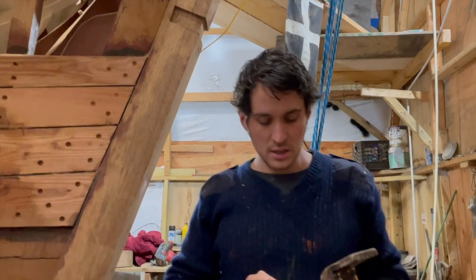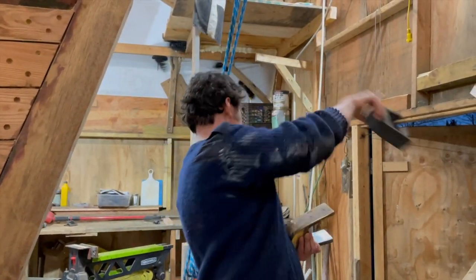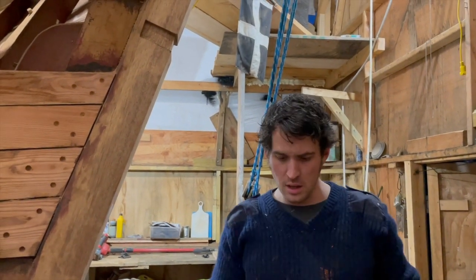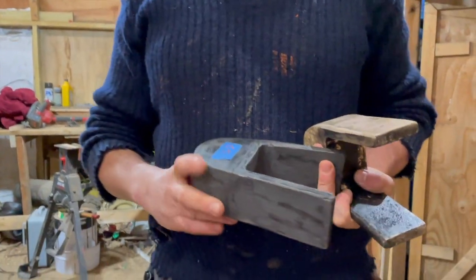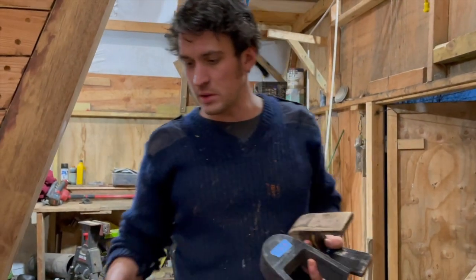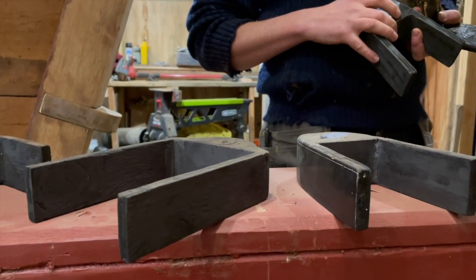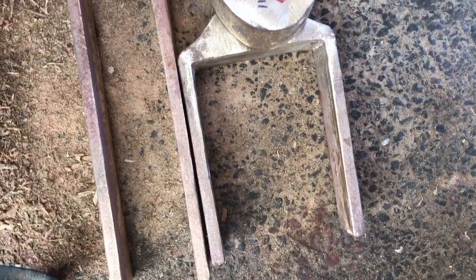And then take it to a foundry, which fortunately there is a very, very good foundry, the Mystic River Foundry, literally right over there. If it weren't cold, I could swim there, to be honest, but it's cold. So, these are very basic. It's three bits of plywood and just a lump of wood to make up the body. You will note that the holes are not in these for the pintles to go in, and likewise, the pintle ones do not have the pins, and that is because it's difficult to get a good casting of something like that, perfectly in line and with a good hole.